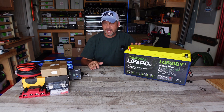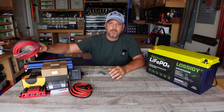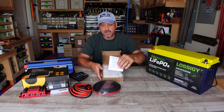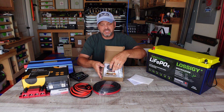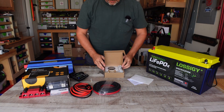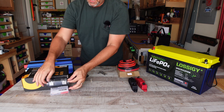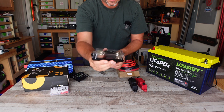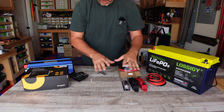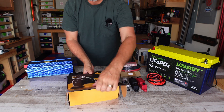I'm going to build a cart, put the battery on it, and I'm going to use basically all of this. I've got my eight gauge positive and negative wire, my big heavy duty two gauge copper wire. I've got this battery percentage monitor with the shunt and the display to help me determine where my battery's at. I'll be using positive and negative bus bars, a 250 amp inline ANL fuse, and two gauge 5/16 hole copper lugs to do all the connecting.